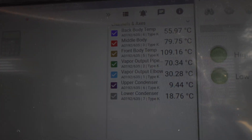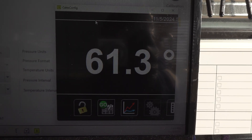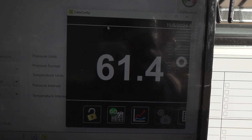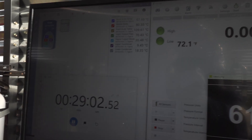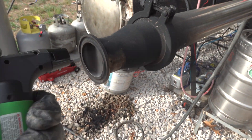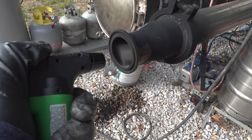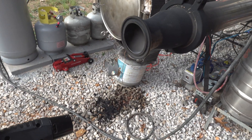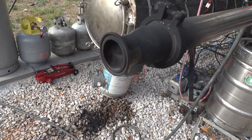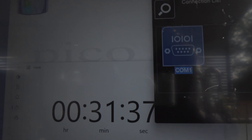I think it could be because of the type of plastic we put in — pretty much almost pure PET, polyethylene terephthalate. But it also could be because it's not shredded and the heat just isn't getting to a lot of the plastic. You can see everything is still pretty cold, 61°C on the infrared pyrometer. Now the front body temperature is 100°C, which is interesting. At this point it starts to catch a flame somewhat — it wasn't completely flammable but it did catch a flame. The flame is invisible so you can't see it on camera, but it was starting to catch but not holding the flame. Thirty-one minutes in.